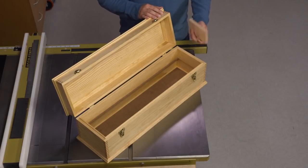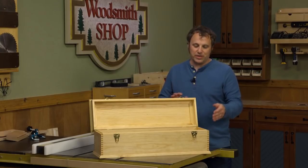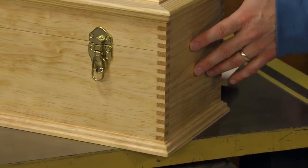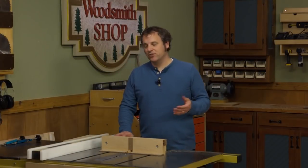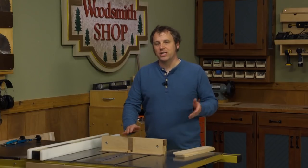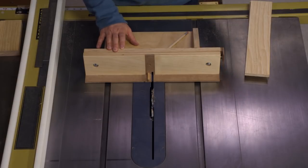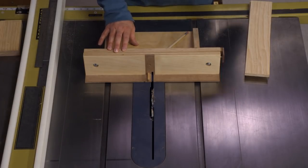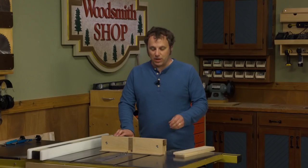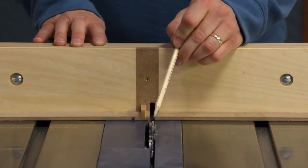What's more critical is the length of the two end pieces — you want those to slide easily into the toolbox and rest on those runners, so the tray won't bind. Once we have the pieces sized, the next step is to cut the joinery. We're going to use the same box joints we did on the toolbox. To cut the box joints, I'm going to use a box joint jig at the table saw. This is a shop-made one, but commercial ones are available — you can find a link for the plans in the description below.